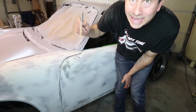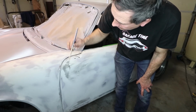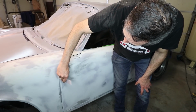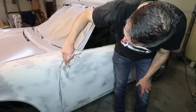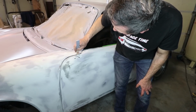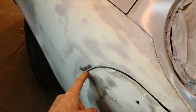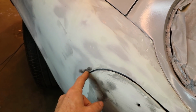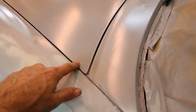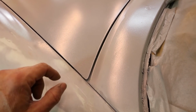And then this is my gap checker tool. If you remember from way back when I was redoing all these gaps, this is basically a paint stick, but I have a 3 millimeter gap right everywhere you go. A little bit of filler in here, so this will clear out. Here's this whole corner. I did tap this piece down. This is ready for additional filler and primer. This corner here, like I said, I reduced the washer stack on the back. It's about a half a millimeter washer in there now. And these gaps are also within reason.